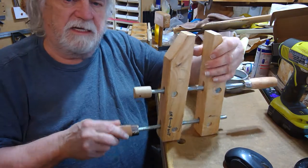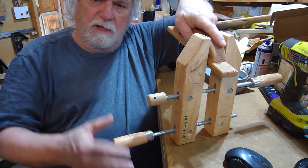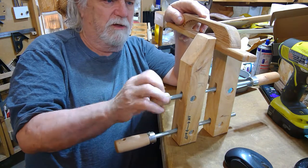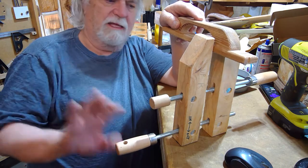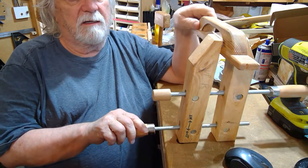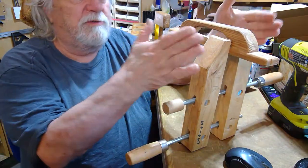Pushing this apart, you can get better leverage at the lower clamp than at the upper one. When you're putting something in there and want to adjust so the jaws are parallel, I might use both of these. If I'm working with one hand, this lower one is my final tightening knob. I put the piece in, look at the jaw alignment, get it where I want it, then take the bottom one and turn it to tighten — quick and easy with just a little bit of snugness.